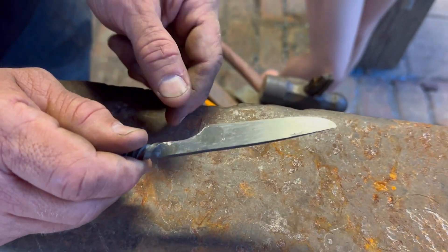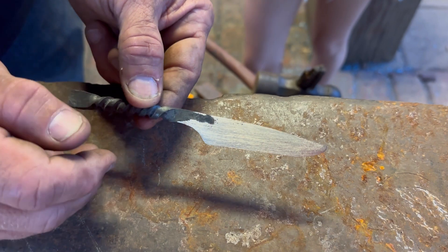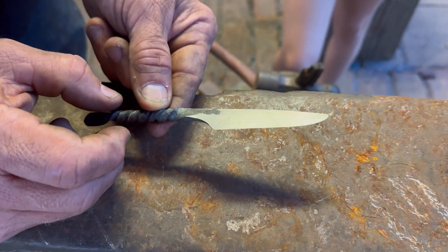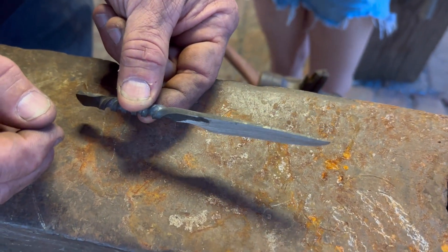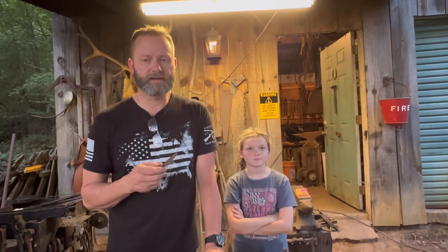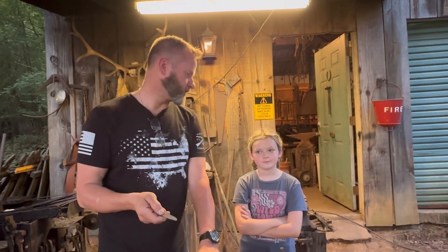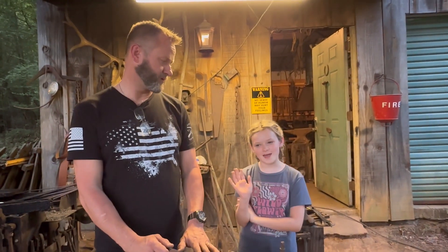Now remember what it looked like before. Here it is — it's pretty clean, pretty slick. You're still going to see a lot of file marks in there, but that's fine with me. I like that — leave a little bit of it in there. We were able to get the edge down like we wanted and get it thin. The bevels are right — it's almost a razor now, it's just not hard. We've got to get it hardened and tempered. But there's the hand filing — just a simple little file, no grinders, no machines. Just the old way, like the old boys did it back in the day. A little twisted sticker all ready for heat treat. Appreciate y'all stopping by. Me and Molly Mae's going to head to the house — it's about supper time. If you watch the channel at all and you're not subscribed, hit that subscribe button. Help us grow this channel. We appreciate it and we'll see you on the next video. Tell them bye, Molly. See you next time.